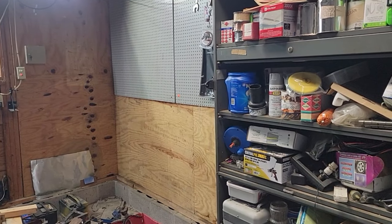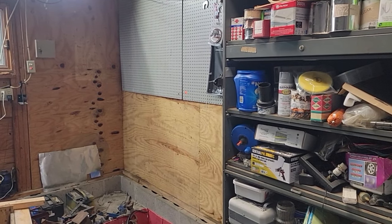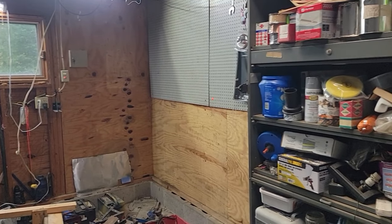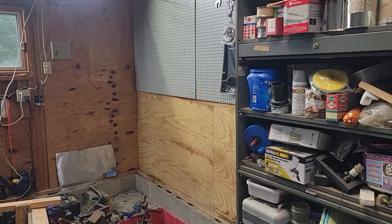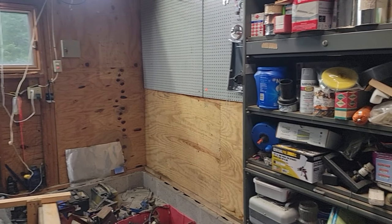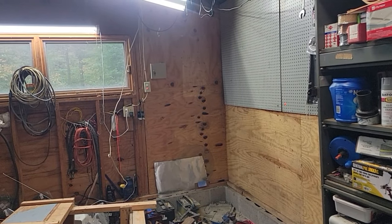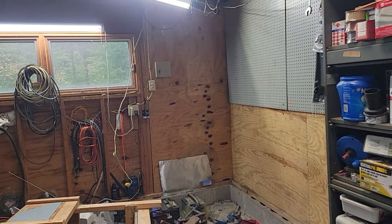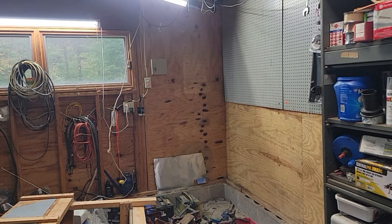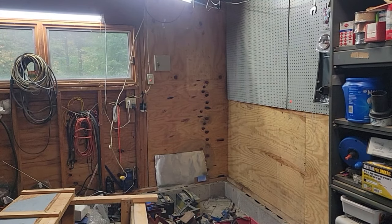On the stairwell that goes down into the basement on the other side, there's a flip-up countertop bench, so I might just utilize that and put my vice back on it. I'm wondering if I don't take this plywood off — if I just measure up and figure out where my thimble goes through the wall and cut my circle, I'll find out right away if there's insulation, and that would save a lot of labor. I can obviously see where the studs are, and it has to be centered with the studs. The numbers are going to work out great.